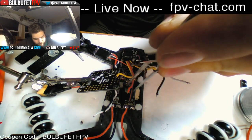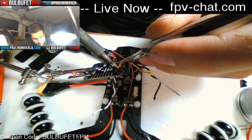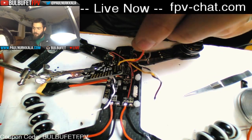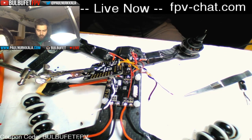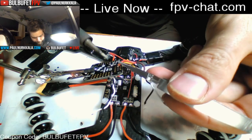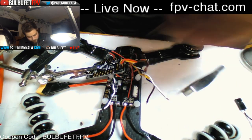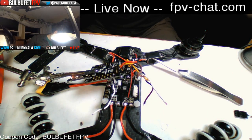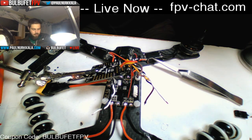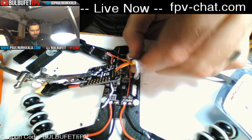Okay, that's ground. This is positive. I've got to tin that a little bit better. Okay, and then we need to reverse TX and RX. Ground, 5-volt, RX. And once again, all of this stuff is available in a previous episode, so if you're confused by what I'm doing, go check that out after this.